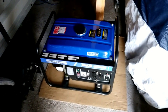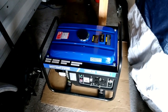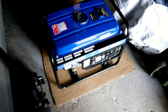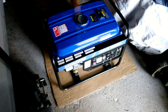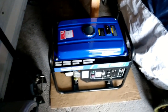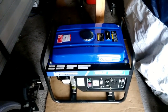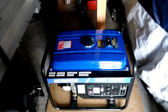I've been pondering getting an inverter generator, which are twice the cost of a standard, but I think it may be a worthwhile investment. A few simple facts: you pay the extra money but you get a perfect sine wave. You also get a decibel drop — usually they're better cased and they'll run about 65 to 70 decibels. This one is running at 96, and obviously that makes quite a difference. I'd like to be able to have a conversation when standing next to it.